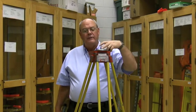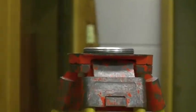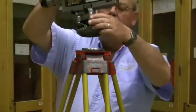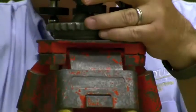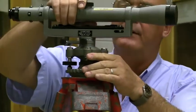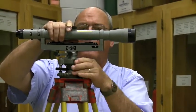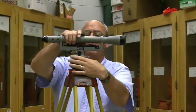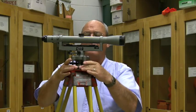This instrument takes a tripod with a threaded top, instead of the flat top tripod we looked at earlier. So you have to take the cap off and the instrument simply threads on. The instrument is made mostly out of brass, but the tripod is cast aluminum — two soft metals. So when you thread this on, if it doesn't thread on easily, it's cross-threaded and you don't want to force it because you'll damage the threads. Thread it on until it stops; do not over torque it, but make sure that it is snug.